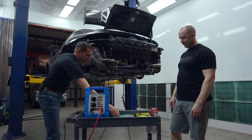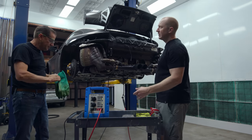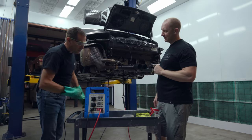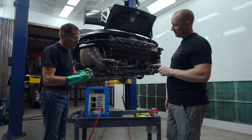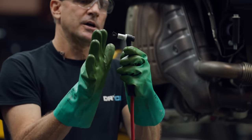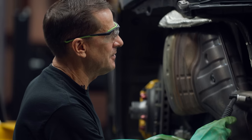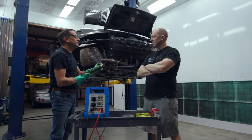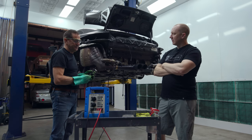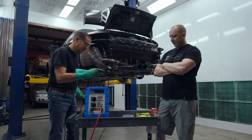I prefer a single brush. They have single brush, dual brush, long brush, short brush. With the kit you get the long and short shroud for the brushes. The shroud supports the carbon fiber brush — that's the hardest part. You don't want to bend the brush over and touch the side, because it burns the filaments and they fall off, wasting the brush. Always work on the tip. The brush is a consumable — it burns through.